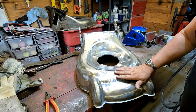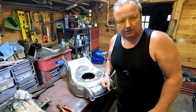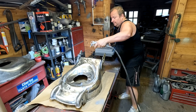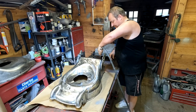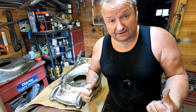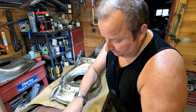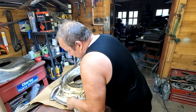It's going to be better than what it was anyway, so we'll leave it at that. I'll give it a wipe down with some acetone and a blow off, get it all clean and then we'll get over there and we'll powder coat it. First of all let's just give it a blow down — get any dust off it. I've just put my homemade oven on, that's heating up now. I'll wait for it to get up to 180 degrees C, and what I've got here is some acetone, so we'll give that a good wipe down just to get rid of all the contaminants we can.